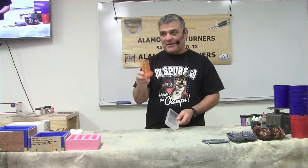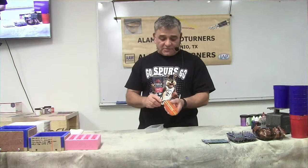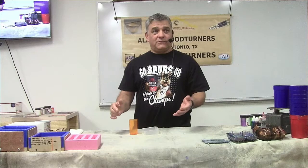This is the perfect size for a bottle stopper - you can make little ones or big ones. You pour the resin in and it pops right out, so they're reusable. After about 10 uses they start sticking if you're not using release. All you have to do is make a 1/16-inch hole in the bottom and use an air compressor - just point it away from you.